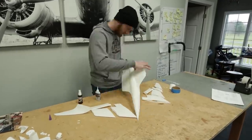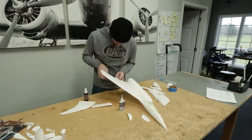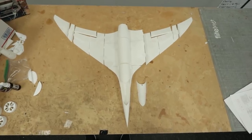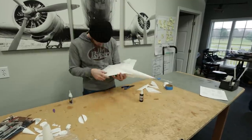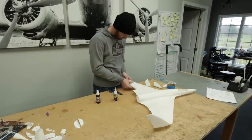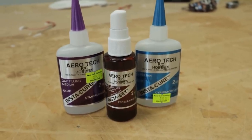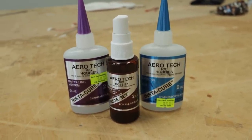The build's coming along pretty good. Thanks to Graham Morgan, who was the guy that actually printed out these parts for us. ColorFab actually sent the plans over to Graham Morgan, and he was kind enough to actually print them out and send them to us. The 3D printed planes are printed in sections, and what you do is you take those sections and you glue them together with CA glue. CA is very different from hot glue — hot glue actually cools down and hardens, while CA is a chemical reaction that hardens it. There's also this awesome thing called kicker, which actually speeds up the drying process of the CA.